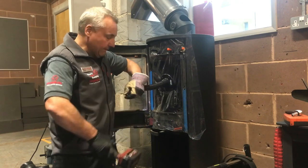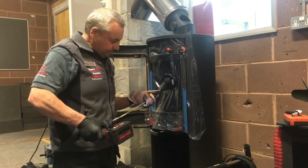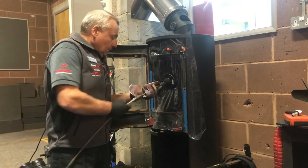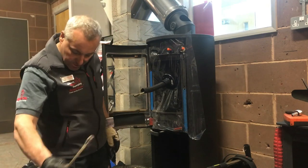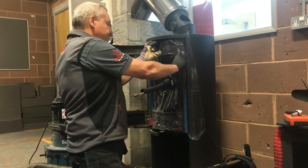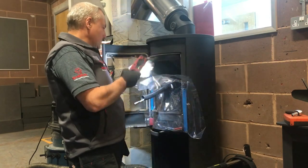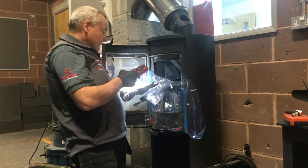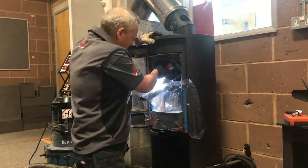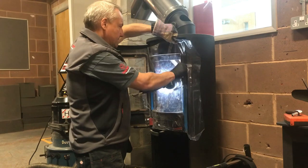We've taken a number of rods down the flue now, so now would be a good time to check and see what was actually coming down. With this nice clear dust control solution we have on here, we'll be able to see stuff starting to build up in the bottom. It would be nice to get hands on and have a look at it — so just deconstruct the top bit, grab a handful and check it over. Is that confirming what you thought, or is it something you now need to be more mindful of? Having satisfied yourself either way, put the solution back.